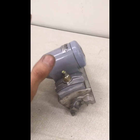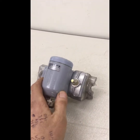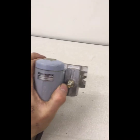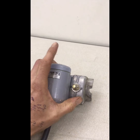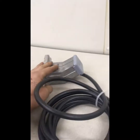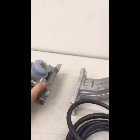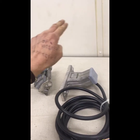The actual axle counter heads come in pairs, so they're doubled up. What you have is a transmitter — a perfectly sealed unit on an adjustable head that mounts onto the rail so you can angle it up and down to the requirements of specifications and the voltages — and also a receiver, which mounts on the opposite side of the rail. The rail sits between the two, and there is a magnetic field influence between the transmitter and the receiver.